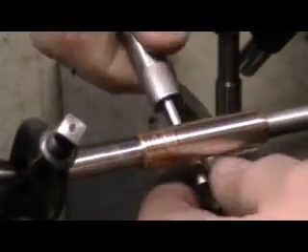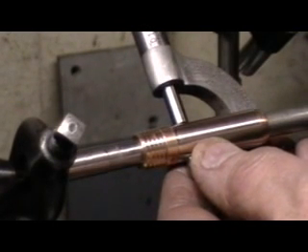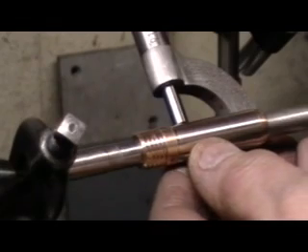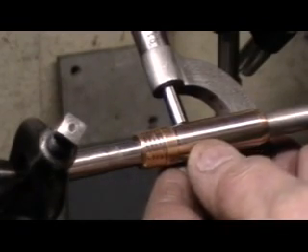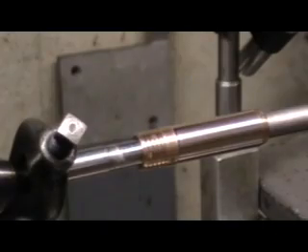Let's see where we're at. The first cut should be about three thousandths off. Yep, so seventeen and a half — take a three thousandths cut.